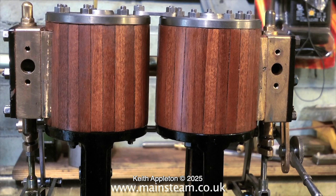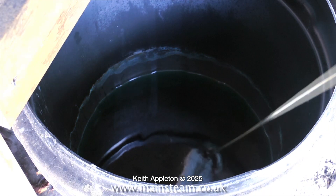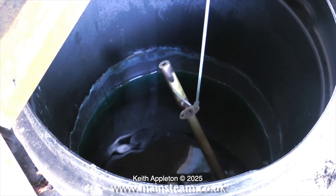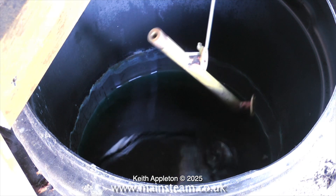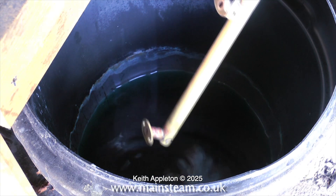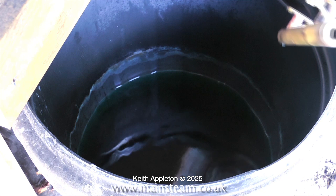The inlet manifold is not yet fully made, so I'll just go through the process and you can see it in detail. Like the exhaust manifold, the inlet manifold is a brass construction, silver soldered together, and at the moment this component is in my acid bath, which is in the outer part of the workshop. This acid bath, or pickle bath as it's usually known, gets rid of all the residue from the flux from silver soldering or brazing.